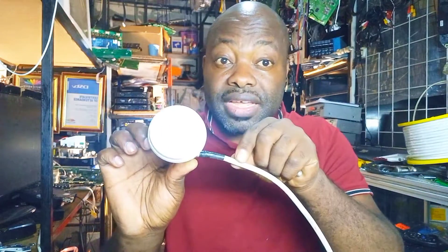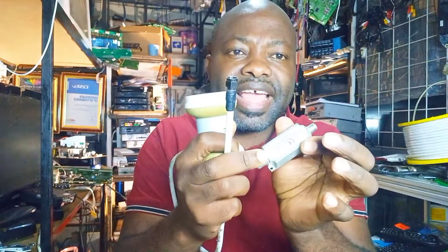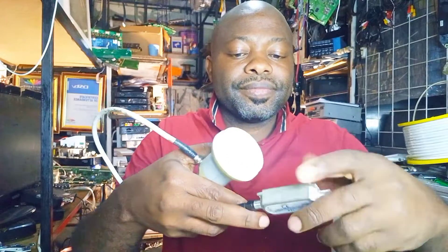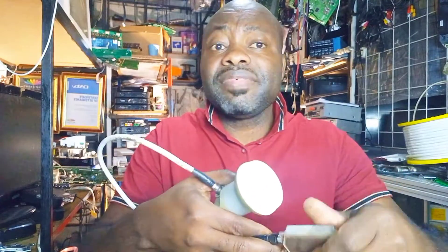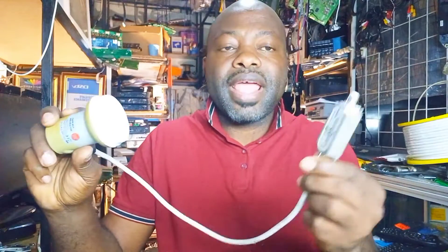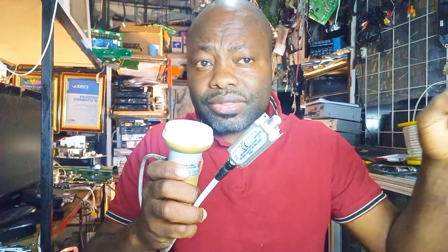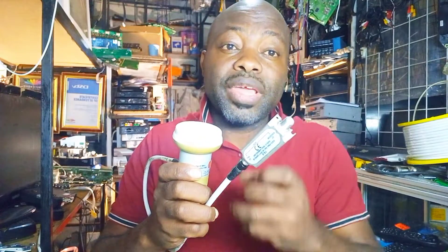You go to your dish and put a short cable on it, then connect it to your amplifier — which has a receiver side and an LNB side. Remember, your decoder supplies 12V, so this amplifier will be powered by the 12V from your decoder. At a certain point along your cable run, connect the LNB side to the LNB. You can place the amplifier in the middle of a very long run, or close to the LNB for a 50 meter run. Place the amplifier about 3 meters from your LNB, then run the long cable from the amplifier to your decoder. That's how you get back your lost signal.